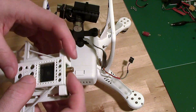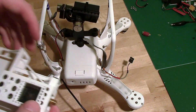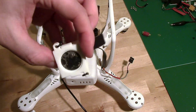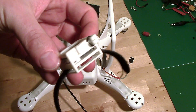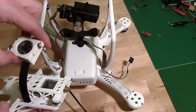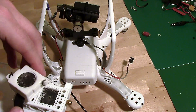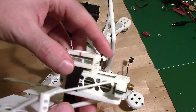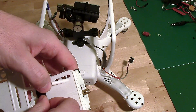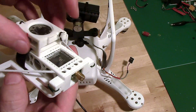I would advise you to just get the TX into the holder first. You'll see there's plenty of space for the cables at the back there. If you do have the power filter — which I have here — this is my power filter holder for the Fatshark Predator V2, also available on my shop. What I tend to do is fit it before I actually put the under tray on. I just use a bit of Velcro, lash it in around the TX, pin it down, and strap that on. It's perfectly secure and it doesn't get in the way of the heat sink, which is what we want.